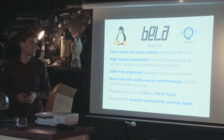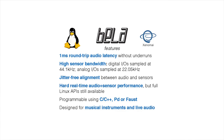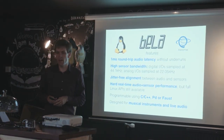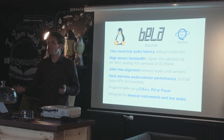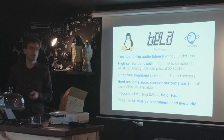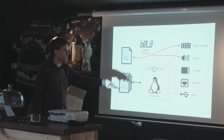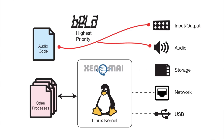The key thing to highlight is this latency issue — the delay between your action and your sound — which is ridiculously low compared to anything else out there. Within one millisecond of the action, you hear the sound. To compare: if I knock on this table, the latency for sound to travel from here to my ear is probably two to three milliseconds. So it's extremely fast, and that's not something you can do with a laptop. It's designed so you get really good alignment between your audio and your sensors, and the performance is really robust — when you load it down, it doesn't start dropping frames or making glitchy noises. It's the kind of thing you could count on in a professional context. Basically, your audio code gets a fast track straight to the hardware rather than going through the normal Linux process, and that's why we get better performance.